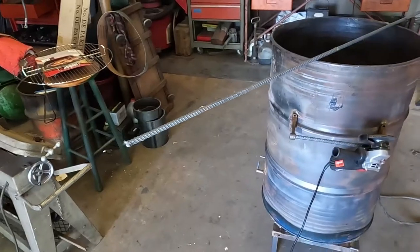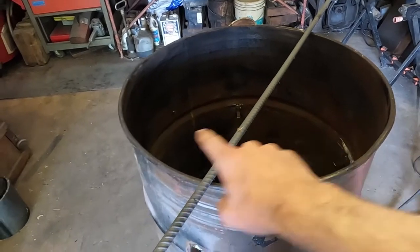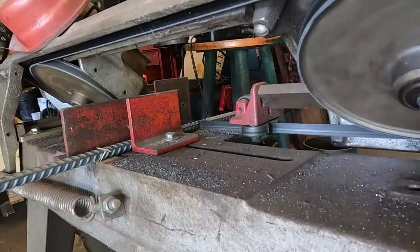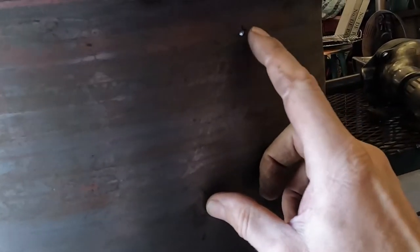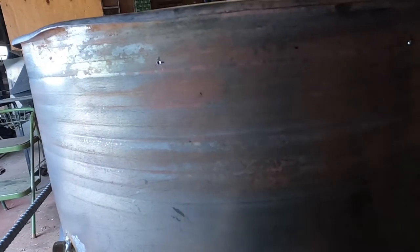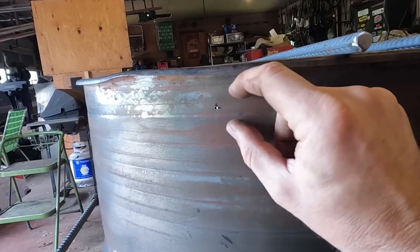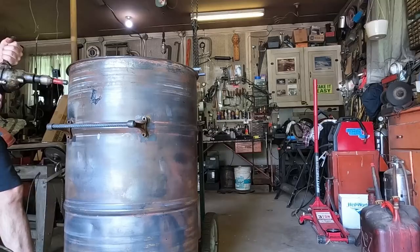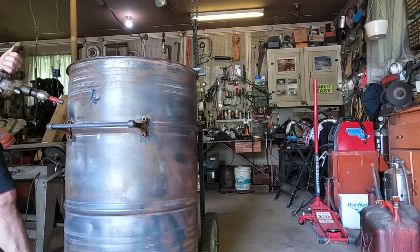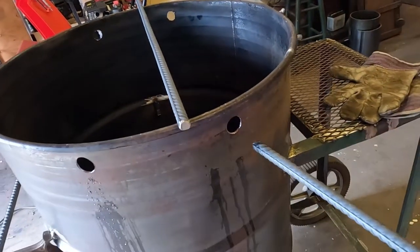Next I've got some half inch rebar and I'm going to cut two pieces that will cross over inside for hanging. I'm also drilling holes with a one inch diameter hole saw — I found the center on either side, spaced four inches out from there and one inch down from the top. These holes will serve as top vents for smoke coming out, and they'll also hold the rebar pieces. With the holes drilled, we've got a functionally complete smoker.